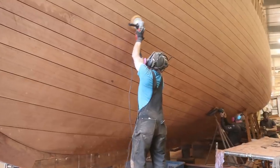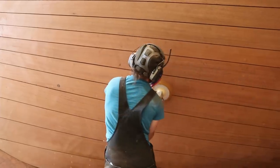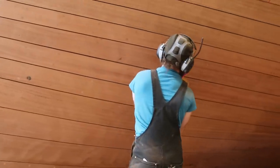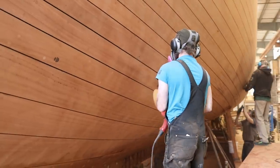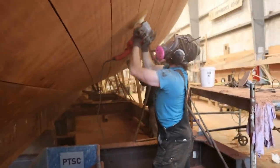The last step in the hull fairing process is to transition to an 8-inch soft pad sander. First with 36 grit sandpaper, and you work your way up to about 120 grit sandpaper. This is plenty smooth for the first coat of hull paint, particularly below the waterline. Remember, in historic times, all this work would have been done with a hand plane and a scraper.